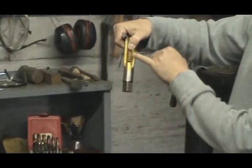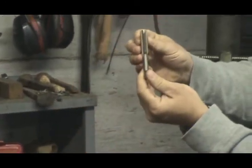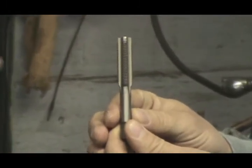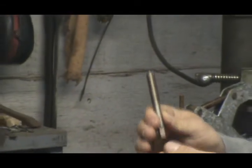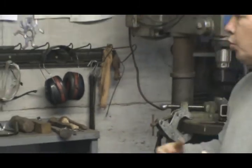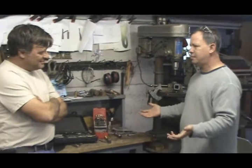My thumb is more or less where an inch is. On this smaller tap you can see that there are many more teeth. So is this a fine thread? Yeah, this would actually be a fine thread. A half-thirteen, thirteen threads per inch, is normal for just a coarse thread. That's basically all it means. To drill for one, to actually tap with it, we don't use a half-inch because that's the same size body as the tap.